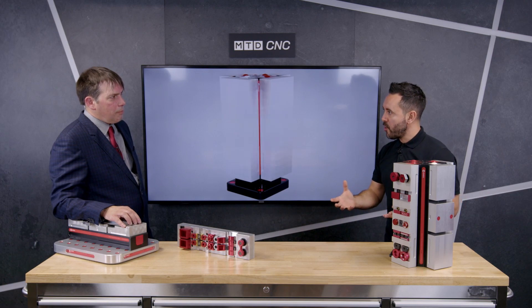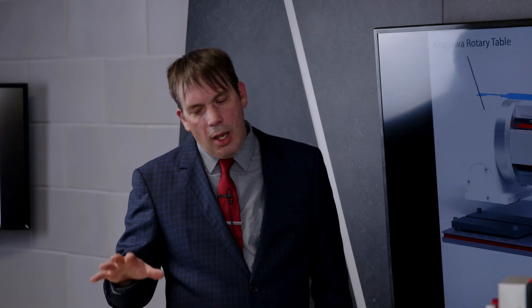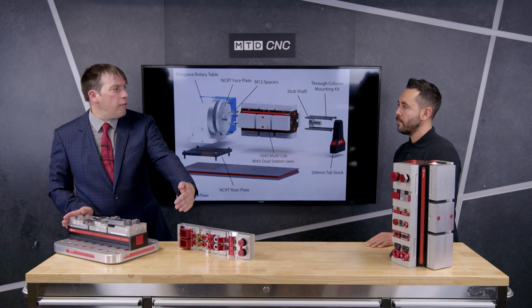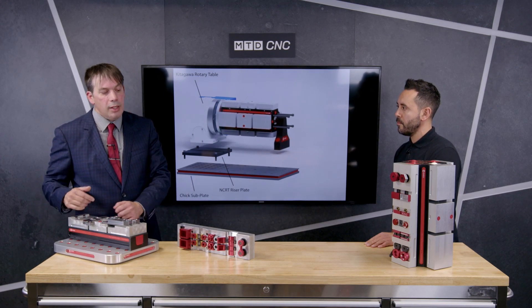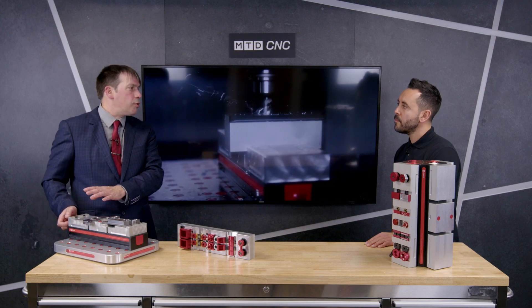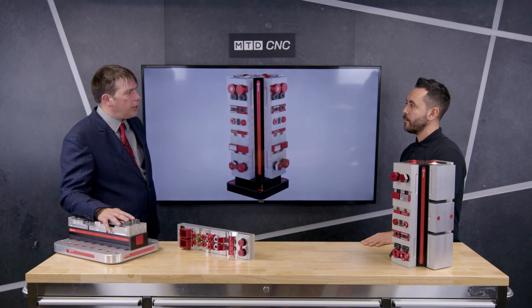The system comes in different sizes and configurations. They all use the same jaws and face plates, but sizes range from 200 millimetres by 50 millimetres up to 500 millimetres by 150 millimetres. Each size has its own jaw type, but jaws also come in different sizes — wider, taller, and oversized jaws for more awkward workpieces needing extra clamping space. This applies to single station, dual station, and face plates. Multi-locks also come in different sizes and configurations to suit swing diameters and all the same sizes are available across both systems.